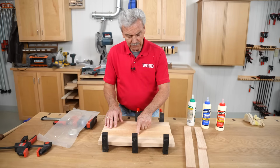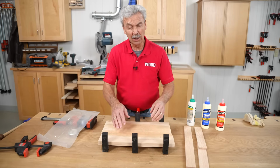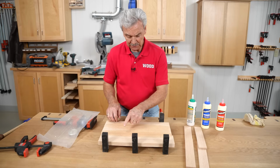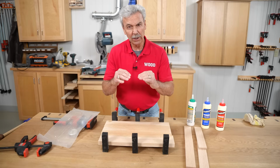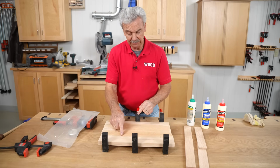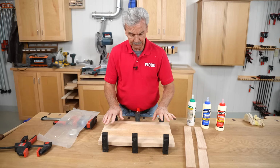Secondly, wait for a while until you sand those seams. Remember, the water in there, the glue, the liquid, has made those seams slightly swollen. If you sand too early, when the water or glue kind of dries, that moisture comes out and may leave a divot between each one. So give this thing plenty of time to do its correct glue.